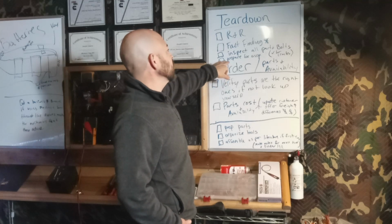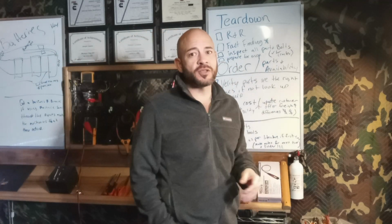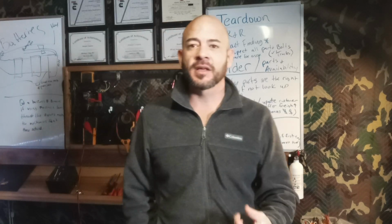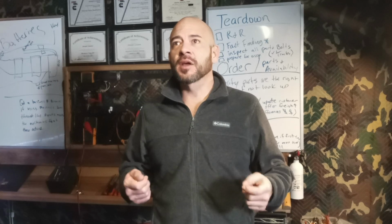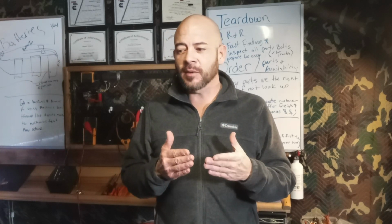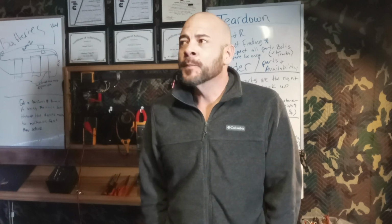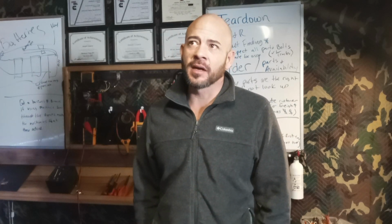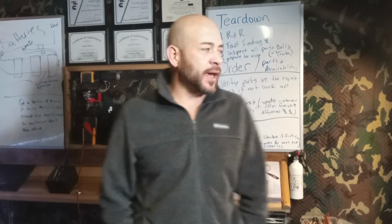Another thing you're going to do is prepare everything for assembly, and there's the same reason behind it as the bolts. If you're going to put a head on, you want to make sure your block and everything else is inspected. You don't want to just clean it up really well. You want to inspect everything really, really well, because that's the only time you're ever going to get that head off to see if those liners are starting to have cracks or if the head or block is showing kind of wear. There are other things too that you want to look at.